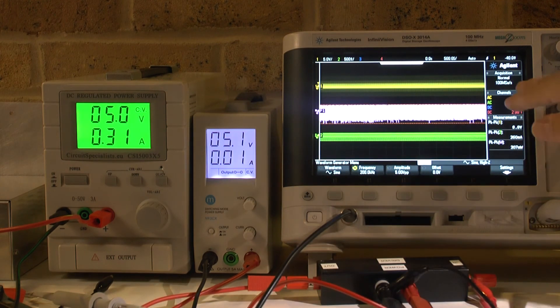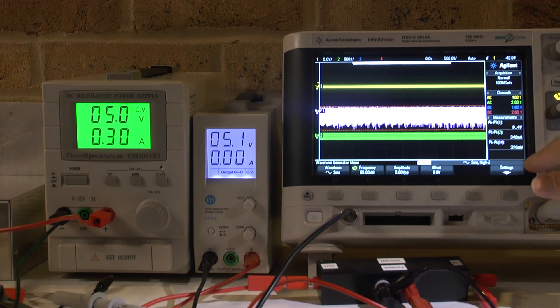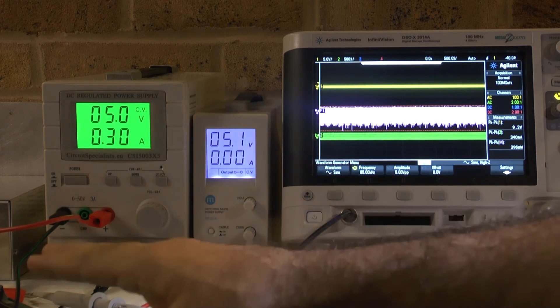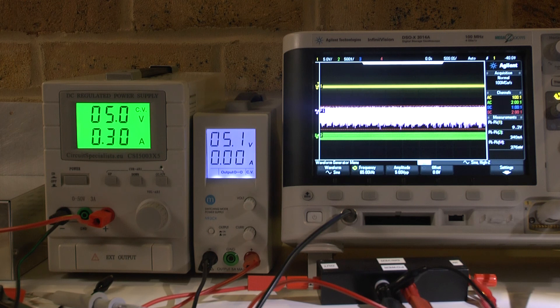I don't want to see any change at higher frequencies, but there was one dramatic change I did not want to see, so the network needs to be optimized. I'm not pleased that my value is not reaching the expected range — that means my output amplifier is not taking full advantage of the available power. The MOSFET can only utilize this energy at higher frequencies, but already I can say there is some deficiency in the system which I can now tackle. This is the conclusion for this video — thank you.